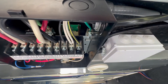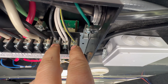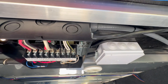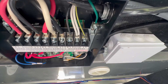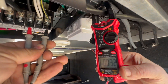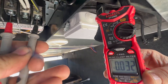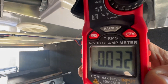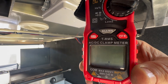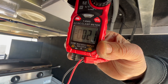We'll start the generator up and measure the voltage between both hot legs. If it's zero, that means we've got an in-phase generator — two legs, in-phase — and then this trick will work. We've got the generator running. We're measuring the two hots and we get zero volts, very close to zero. Now if we measure neutral to hot, we should get 120.